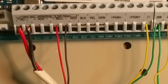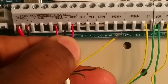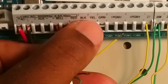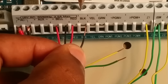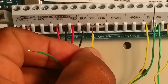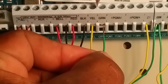Next we're going to wire up the keypad bus. All the keypads go on the same terminal in parallel. Plug in your red — the board will actually tell you which color to plug in on the keypad and on the board. Then black, yellow. If you didn't have a yellow and it was white, it's the same thing — use white for yellow. Green for green.